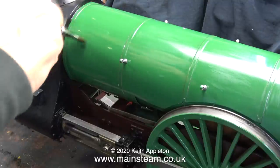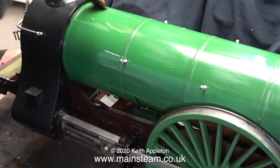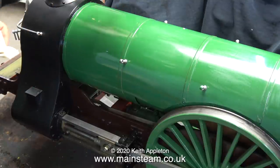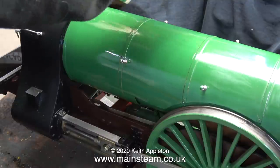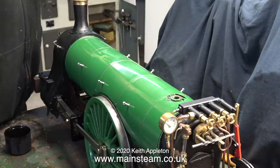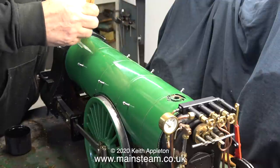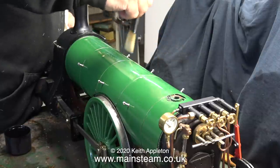You may be thinking: why don't you spray the varnish? Yes, a very good idea, but the whole point of brushing this varnish on is that I want this engine to look something like the original Number One in the York Railway Museum. Although this particular engine is not a model of Number One, it's a model of a later one, I'm trying to achieve a specific type of paint finish. Full-size steam locomotives are usually painted using coach paint, which as far as I'm aware is oil-based enamel. When I look closely at Number One it looks to me like the paintwork has been varnished over the top of the coach paint, and that's why I'm doing it this way.